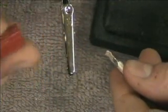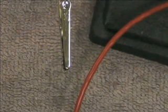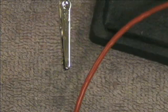So next step, we'll take that and then you just want to take your case here - the actual connector I suppose - and you want to make sure, looking at it from this angle, you get that metal piece and we're going to have that facing up this way. Then you want this little loop facing towards the metal part. What will happen is you just slide it in there and push it in. You may have to use a screwdriver, especially with this lower gauge wire. Grab the screwdriver here, just a real small - I'm going to use a 5/64ths screwdriver. Once you've got it all lined up, push it in there and then just take the screwdriver and press down on this contact.